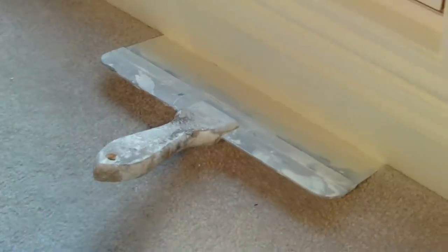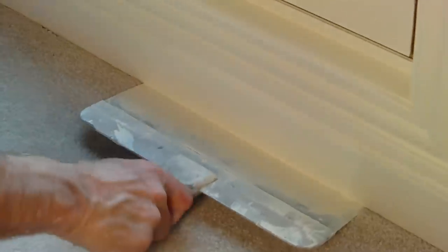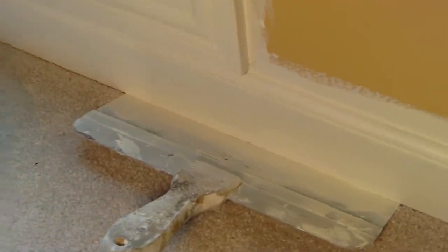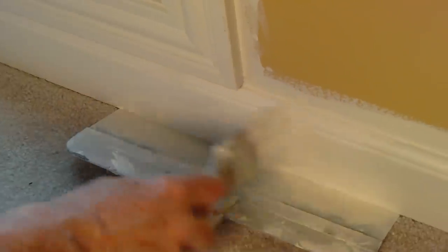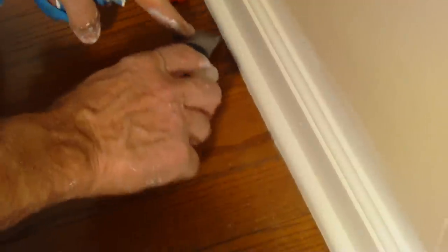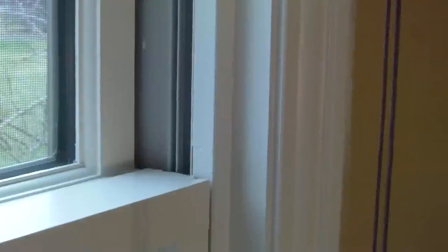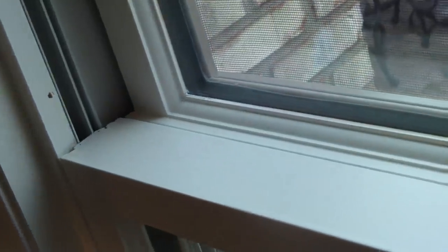Here's a little trick for painting baseboard over carpet — we just use a drywall blade. With this technique, you wind up with an incredible finish. You don't have a lot of dust from sanding. You wind up with a finish that's just like a piece of china.